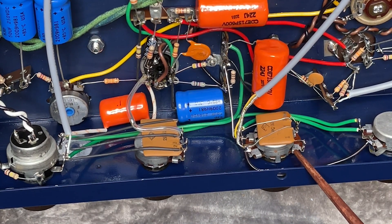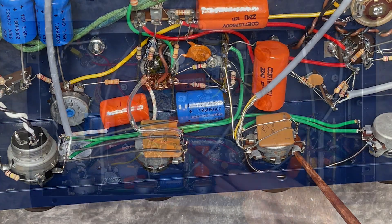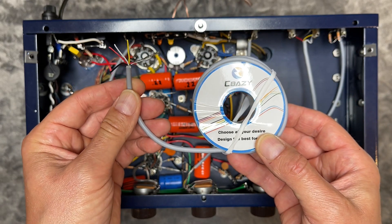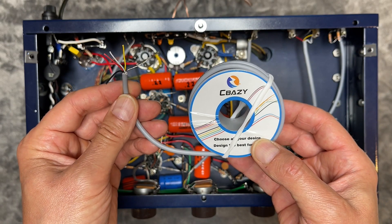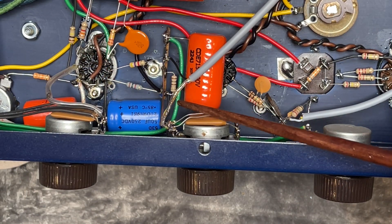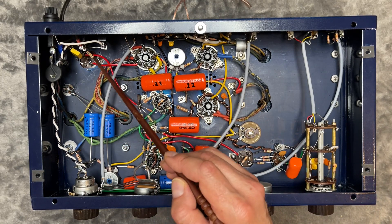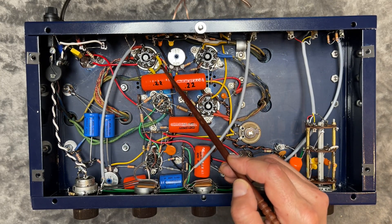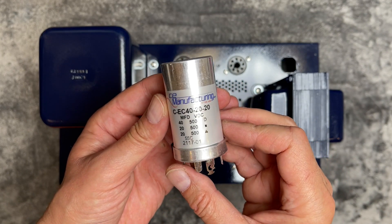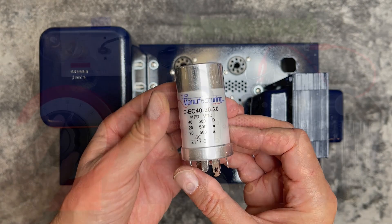These early integrated circuits contain an array of capacitors and resistors for the loudness and tone functions. The amp required four shielded cables, and I used four conductor cables for all of them, even though some only required one or two — unused conductors were trimmed off accordingly, and clear heat shrink was used on the braids. The manual didn't call for it, but I soldered all ground points to the chassis. I was also able to find new multi-section capacitors in the correct values, and those were used to help keep things as original as possible.